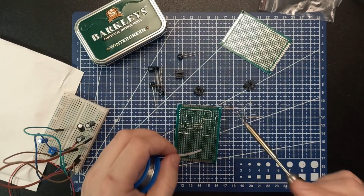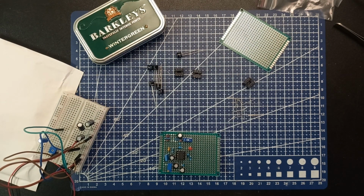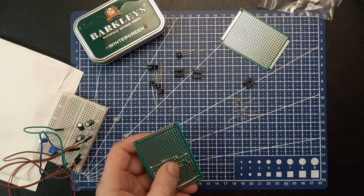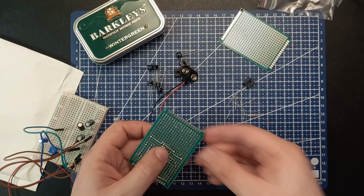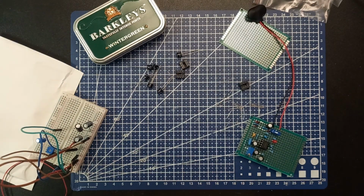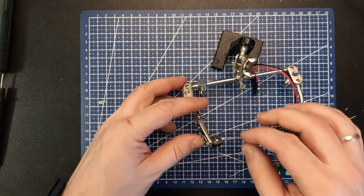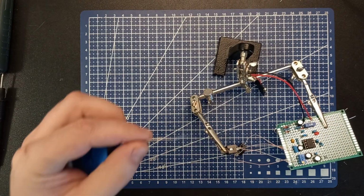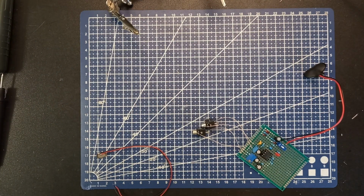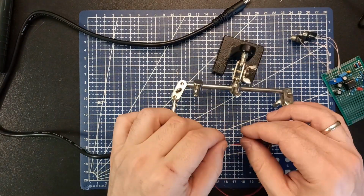I made 3 different sets of feedback capacitor and resistor pairs to find the most suitable gain. Resistors are 1 meg, 9.1 meg and 1 giga ohm. Capacitors are chosen equivalently, which gave a cutoff frequency of about 30 Hz. As some preliminary tests show, the 1 giga ohm feedback resistor with the smallest capacitor produced a gain of more than 26 decibels, which is quite harsh.